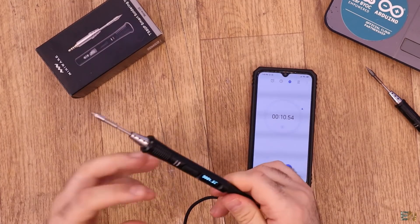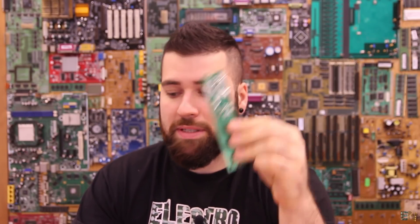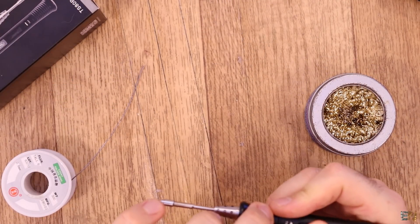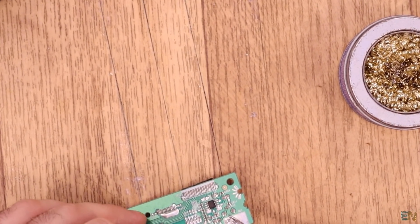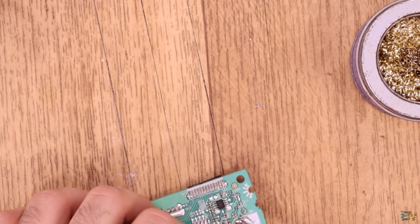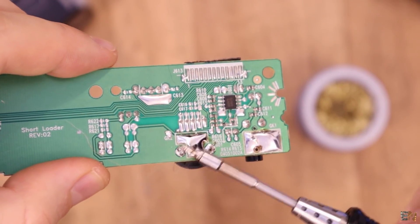I can't be absolutely certain the tip is exactly at 300 degrees without measuring with an external thermocouple, but I'm pretty sure since I've already tested the old version and it got to 300 degrees in around 15 seconds — and with nearly double the power, 8 seconds makes sense. Now let's test more. I'll make a large ball of solder on this PCB. Let me increase the temperature a little to 350 degrees. Now the temperature is rising — let's try to solder a big ball of solder. As you can see, even with a lot of solder, it has the power to keep it all melted with no problems.